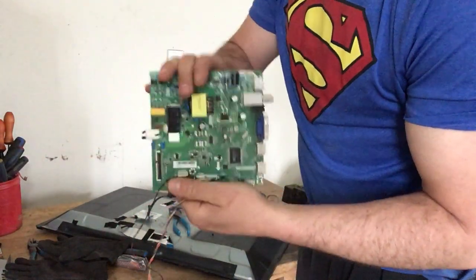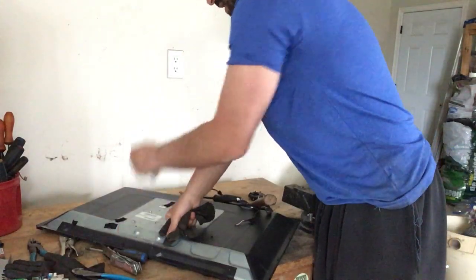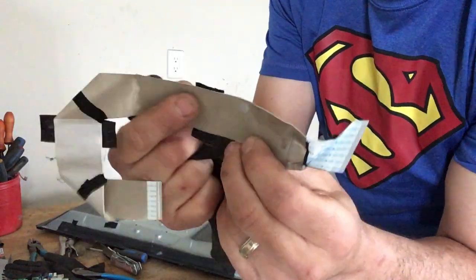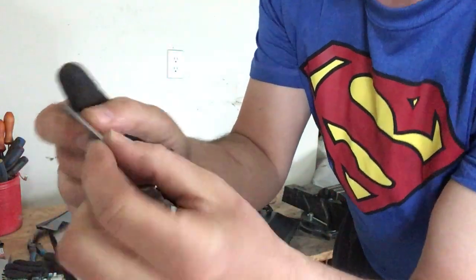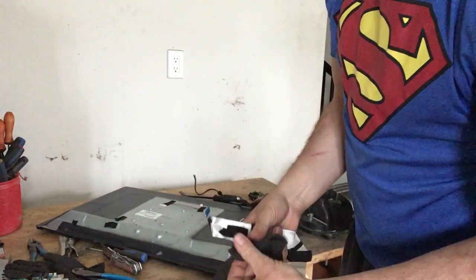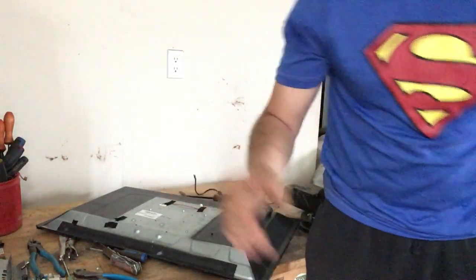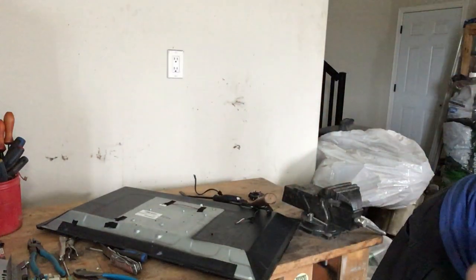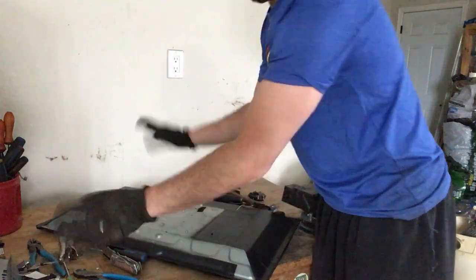I have another low grade board. This connects to the circuit board and it's actually a set of wires with silver tips on the ends. What I do is just cut this piece off and put it in my silver bin along with my silver contacts. There is a silver oscillator on the board, so all of that goes into a little container of oscillators and silver contacts — and one day hopefully I'll hit it with some nitric acid and get a silver bullion.